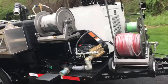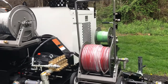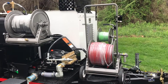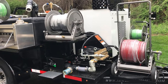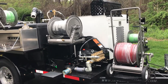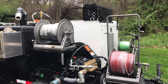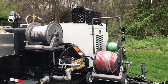Your half-inch jetter hose would attach to the adapter, which has a gauge on it. That way you can take these directly to your clean-out and do your jetting right from there without having to have 300, 400, 500 feet of 3/8, 1/8, or quarter-inch hose connected to your jetter, which greatly reduces your pressure drop. 500 feet of 1/8 inch hose literally causes you to lose thousands of PSI, whereas going through 500 feet of half-inch hose and then just 100 feet of the small hose greatly increases your performance at the nozzle.